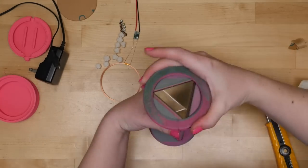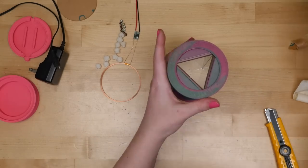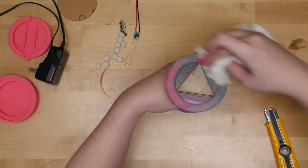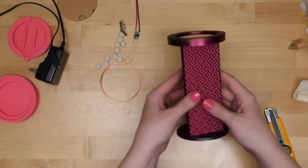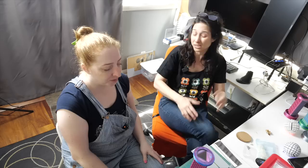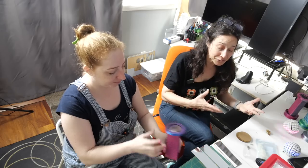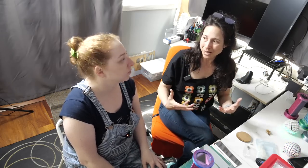You can use any thickness of acrylic, because you don't know when you buy these discs — and that's why I purposely did a screw top. You could laser cut as long as it's between a millimeter and an eighth of an inch. You can buy these pre-cut, buy millimeter-thick acrylic, or even cut it with scissors in a circle because the edges are going to be hidden. The whole point was more people have 3D printers, so I wanted to make it so anybody could make it without a laser cutter.